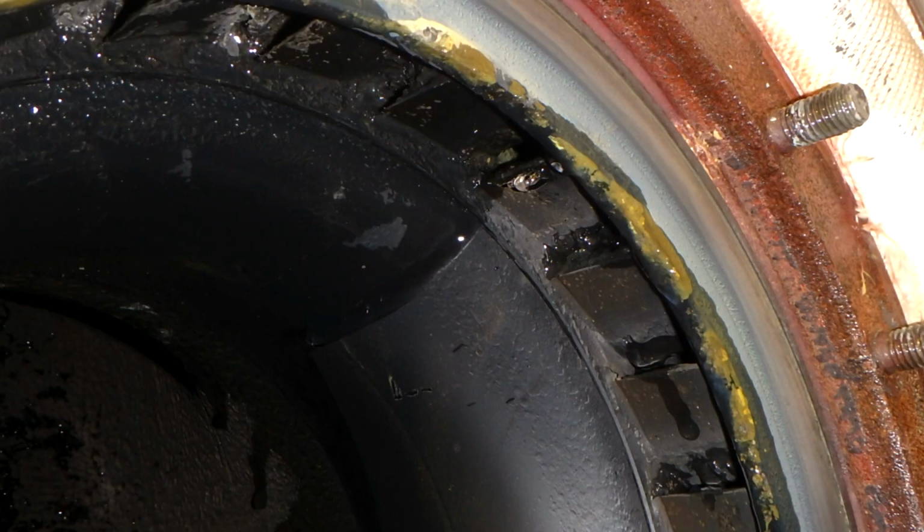Very important is to regulate your water distributor and pressure regulator at the proper flow, because there's a flow indication on the piping and the pressure. This is very, very, really important. So before you attempt any washing of your turbocharger, you need to verify that all the quantities are proper and all the pressure is proper.